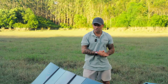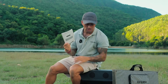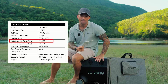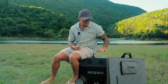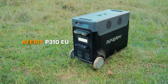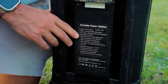To check if a solar panel is compatible with your power station, look at your user manual and the specifications on your power station. Find the max voltage input on the power station. As long as the max voltage output on the solar panel is under that of the power station, you should be compatible. For example, the AFRI P310 XT90 has a maximum input of 160 volts, meaning I can hook up a solar panel up to 160 volts without damaging this power station.